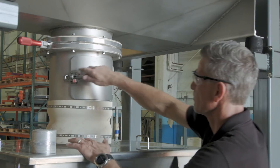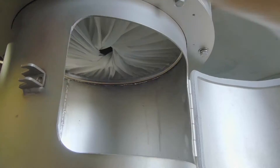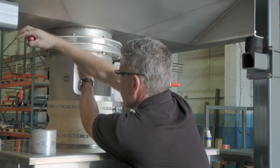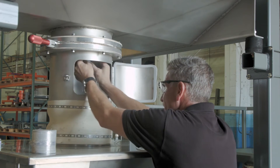The operator can then open the access door to reach the bag spout. If the unit has an iris valve, it can now be opened via either a trigger lock or a twist handle lock like the one shown here. The operator then pulls down the bag spout, closes the iris valve, and can untie the spout.